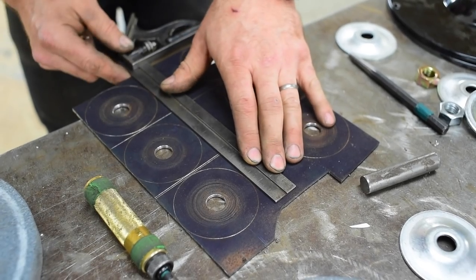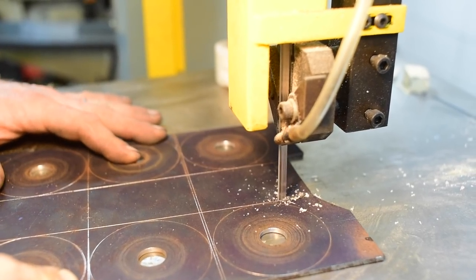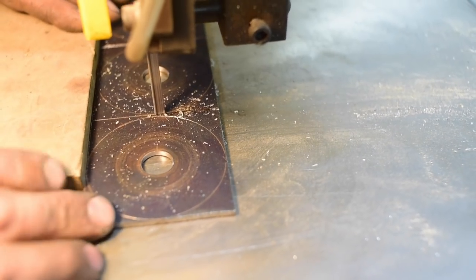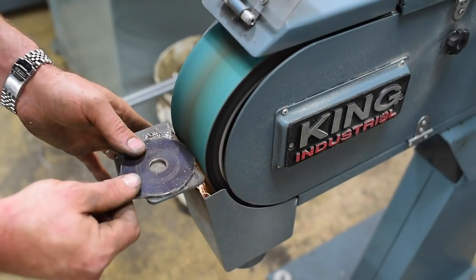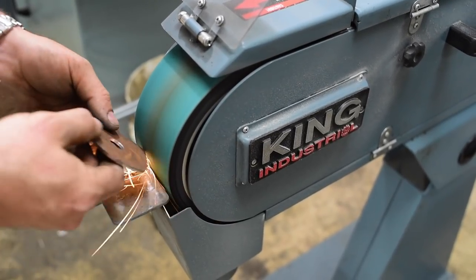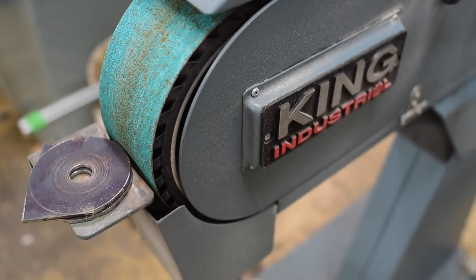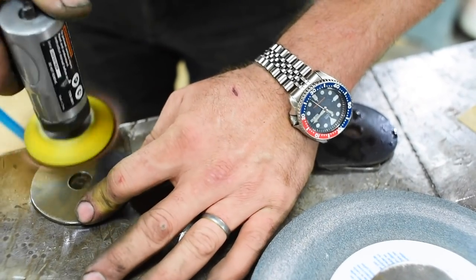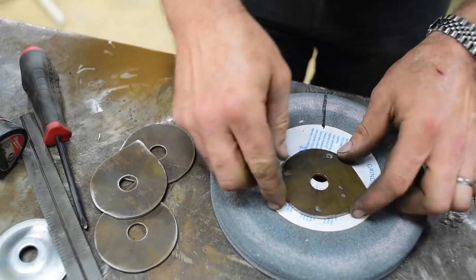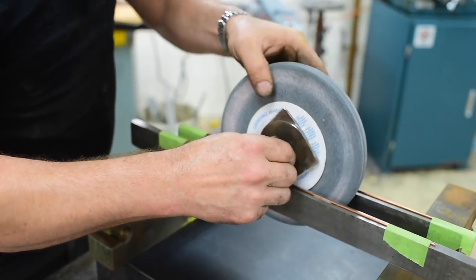Unlike a wheel, we can't just stick lead weights on. So we're going to make up some metal flanges that have a lobe on them. Because we know we've got one heavy point on the wheel and two adjustable flanges with lobes, we can adjust those flanges until we get an absolutely — or very close to absolutely — perfectly balanced wheel. To make those flanges, I'm going to use some eighth-inch material. Depending on how big your wheels are, you can make it out of 16 gauge or whatever you have around — just make sure the stack-up isn't so thick that your grinder nut won't fit on. I'm going to mark them out on a sheet, band saw them out, then deburr them on the belt sander. At that point, I'll be able to mount them onto the stone and balance the wheel.